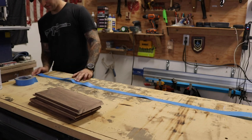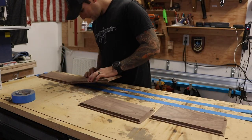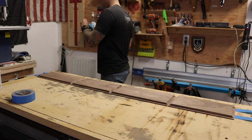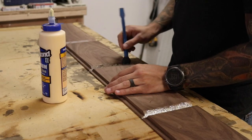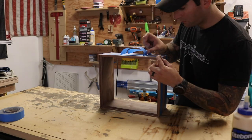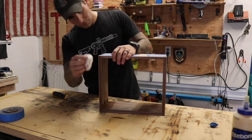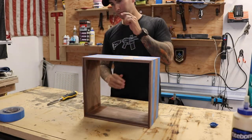This is a great trick — I'm sure most of you have seen it before — the blue tape painter's tape trick. It's tricky to glue up mitered joints because if you put too much pressure they'll want to slide on you. So you put them all on a strip of blue tape, glue it all up, and roll it up like I do here — the tape acts like a clamp. I used an old chisel to clean up the glue squeeze-out and then used my little Woodpeckers mini square to make sure all the corners were at 90 degrees. Everything ended up perfectly square on the first go, which is extremely lucky.